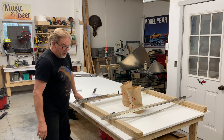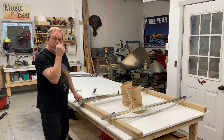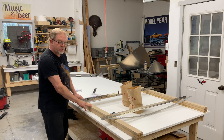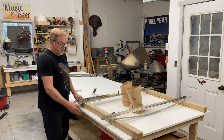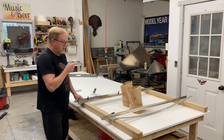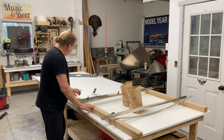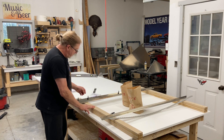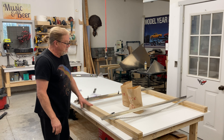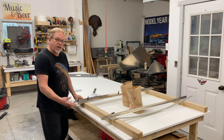In case anybody doesn't want to buy steel tubing — I couldn't find any locally and was going to have to have it shipped in — I thought, well, I've got this leftover from a piece of four-foot fiberboard. This stuff is so accurate; it measures out perfect three and three-quarter inch pieces, gives me enough height, and I don't have to worry about a two-inch cleco hitting the table. I made five of these in about an hour.